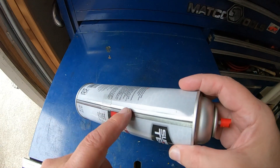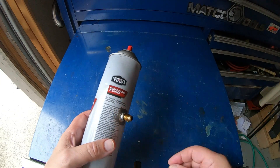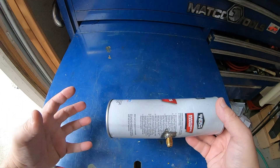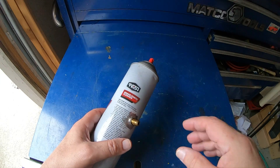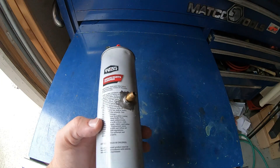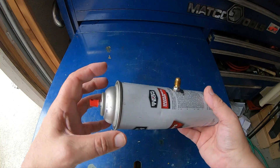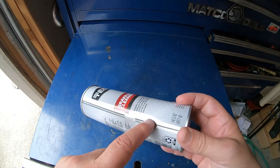It's going to be interesting to see what ends up giving up first. Pretty much the same as the last one — I'm going to hook my 6,000 pound nitrogen bottle to this, got a pressure gauge. I'm going to try to set it up better this time so that whenever the concussion happens from the explosion, it doesn't black out the camera. I'm going to have the camera sitting up off the window a little bit so the shock doesn't jar it so hard that it loses the video footage. My guess is either this end's going to blow off or this end's going to blow off. I don't think the fitting is going to give and I really don't think this weld's going to give.